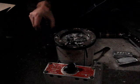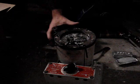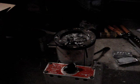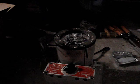this stuff here, which is 50-50 beeswax and Alox. This is standard bullet lube. I just take a little chunk of it and stick it on the side of my reject can here. You're going to roll up a little piece about the size of a pea, and you're going to drop it on top of the lead, let it melt, and we're going to burn it. What that's going to do is help the mix to clean itself and also help it flow through the spout down on the bottom. And once we start pouring, I'm going to reposition the camera so you can see more of what's happening.